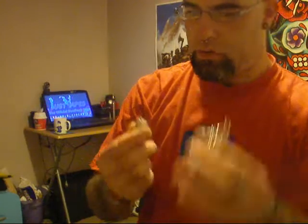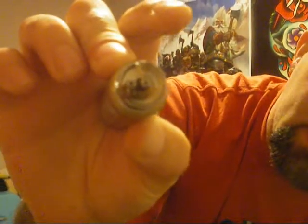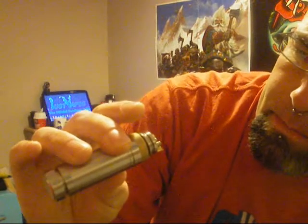You'll be going below 1 ohm in resistance, which currently, as we saw with the Yager, I managed to get my dripper down to 0.7 ohms, so I'm going to attempt to get it lower. If I grab the dripper — there's no battery in it — you can see it's a different formation of my wick. It's doubled over and in an S shape, but clamped on one side due to the nature of the dripper. I managed to get that down to 0.7.